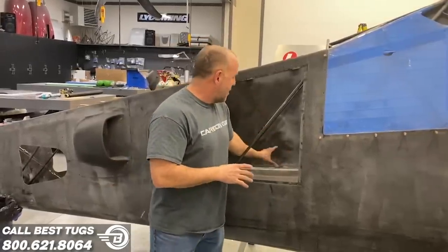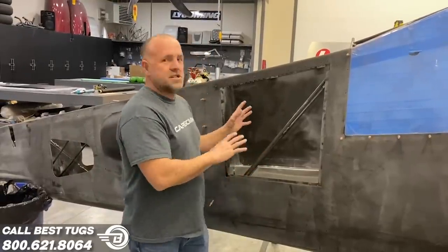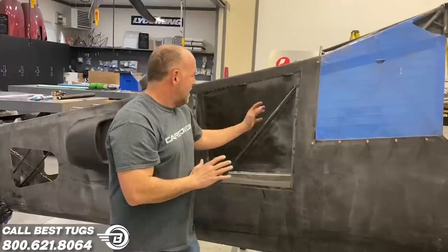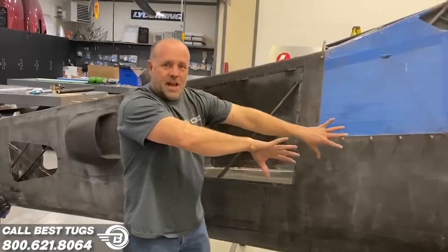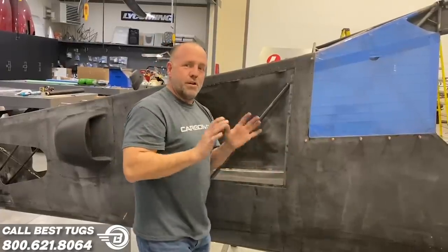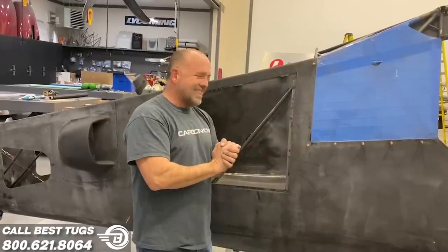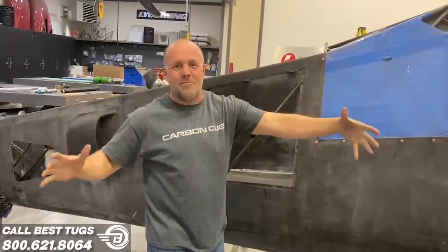So I'm going to lay up the carbon fiber. It closes out all the luggage area, so that no luggage can hit any cables, any controls, any fuel lines. Everything is hidden all the way from the pedals to the back. So I'm gonna carbon those up, make 2 more up front, a couple of decorative interior side panels out of carbon fiber, and some big footrests for the person in the back seat to have a place to plant their feet so that they're not feeling like they're sliding around in the seat. So I think that's it. Then later, great big giant carbon fiber wings for my gear legs.